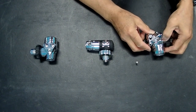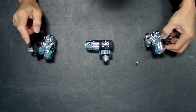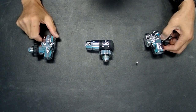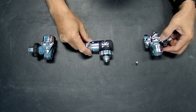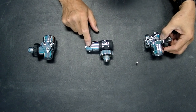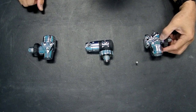So these are three basic considerations for regulators. There are plenty of people who use first stage regulators for decompression purposes that have fixed ports, and there is absolutely nothing wrong with that. However, many people will prefer to have a cleaner layout with the tank and the hose, where you'll need a rotating turret, either with a piston or with a diaphragm regulator design.